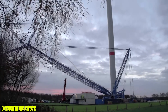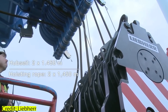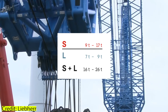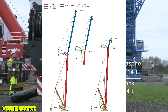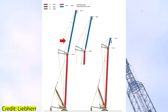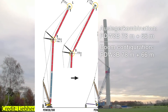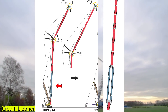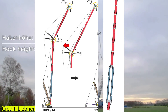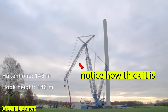On the LR 11000, the power boom system works in exactly the same way, but its assembly is a little different. On Frankencrane's power boom, the heavy sections are used for the boom while the lighter sections form the luffing jib. On the LR 11000 however, the double boom structure of the power boom is made up of lightweight sections — and this allows the luffing jib to be made of only heavy sections, forming a stronger jib than would normally be possible.